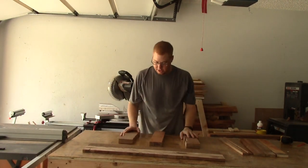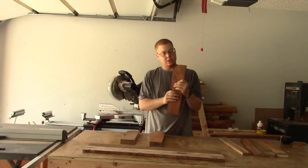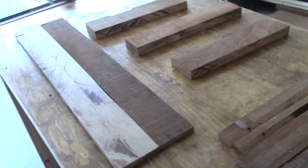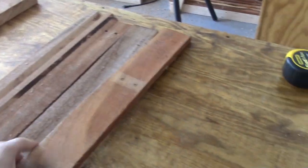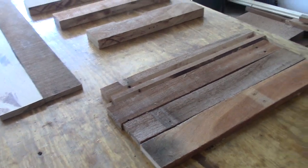I got all my boards cut here. I went ahead and rounded over these edges — I'll just cut those on a bandsaw. For me, this is one thing I like about pallets: these are rough looking boards and once we sand them, they're going to look really nice. What's also cool about pallets — if you're just getting into woodworking — pallet wood is very hard and not usually straight. But if you cut a board wrong, pallets are usually free, so if you throw it away you're not really out any money, just out of time.